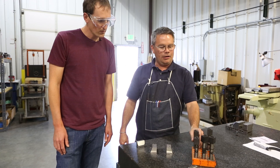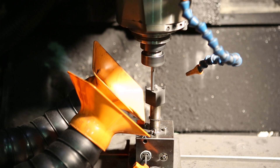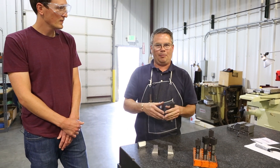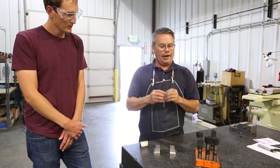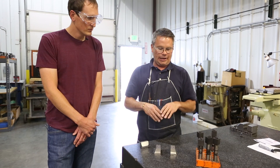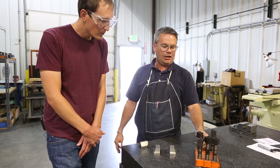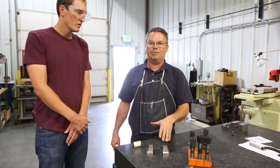Because of the size of the detail we went ahead and made some electrodes. An electrode works almost like an abrasive material — the easiest way to explain it is like sandpaper with different grits. This carbon graphite has different grits, and the way it works is the spark jumps from the electrode and erodes the steel instantaneously. It looks like an electrical storm is happening but it's actually one spark at a time. These electrodes go in an EDM machine on location, erode the steel, and burn the shape into the steel.